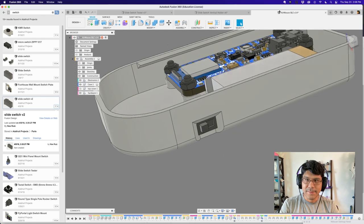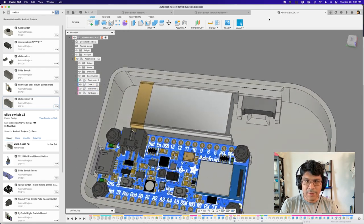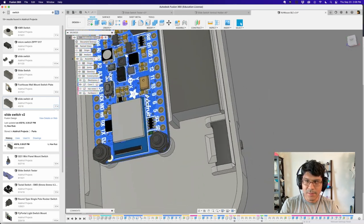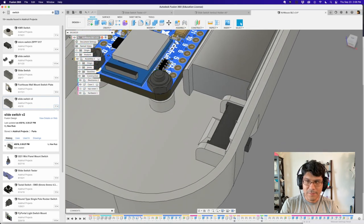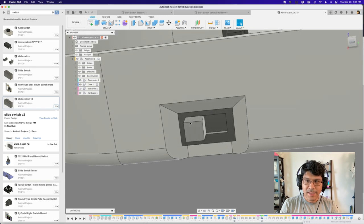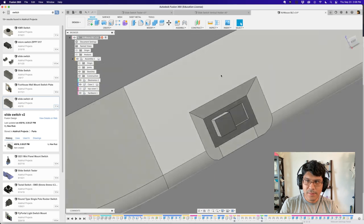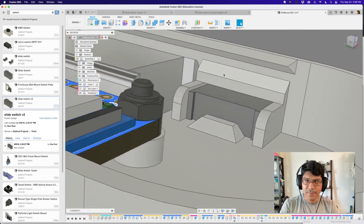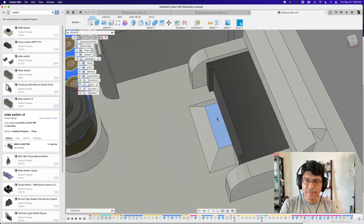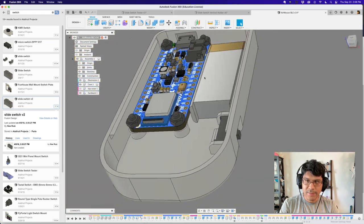And then here is the enclosure that I shared, the little purple one. This shows how a feather and a battery can fit into this enclosure with the slide switch right there at the bottom. Here you can see the actuator is open, and you have some drafted angles. On the inside, you can see that bridge, those two walls, and this third one here, which is an end stop. That's how the shape works inside of this enclosure.